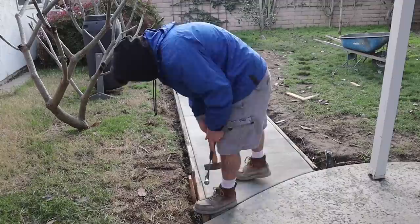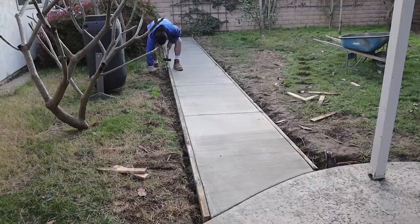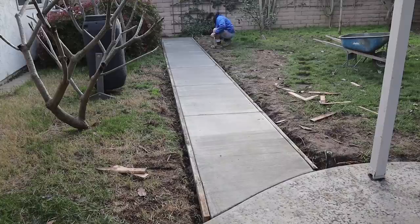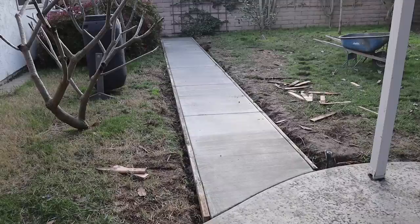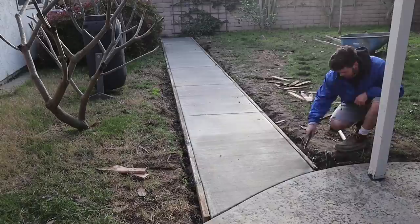Here's strip day. We use duplex nails on the forms so they're easy to grab with the claw hammer and pull right out. And you can see how easy those stakes came out — because they were sticking up above the board and easy to grab, not flush to the top. They came out in one piece and are completely reusable.